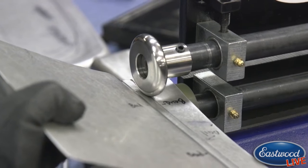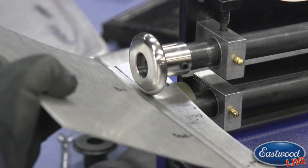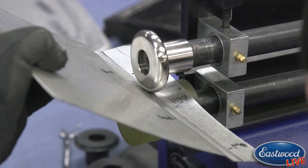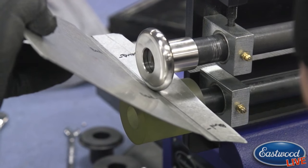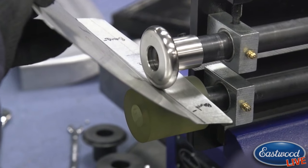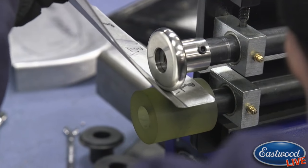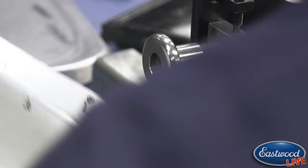Now you don't want to try and make a 90 degree bend in one pass. You're going to start slipping out of the wheel, or it's going to make the soft lower wheel want to walk just because of all the pressure. So go through in a couple of passes. Depending on the metal, you may need to do 3-4 passes, or even depending on your skill level. You can just do it as many times as you want. Sometimes you can just run a pass through with almost no pressure and it will score.